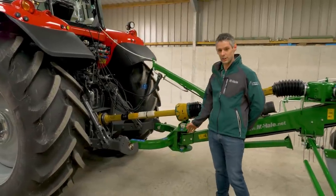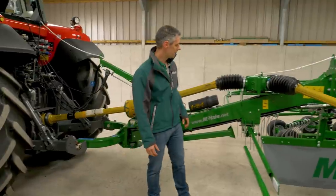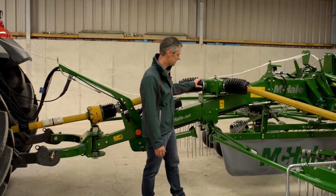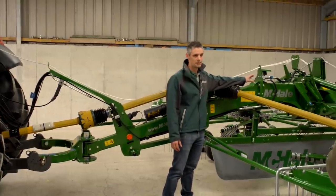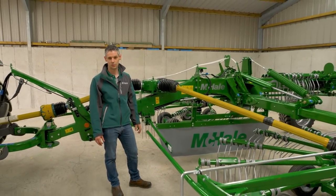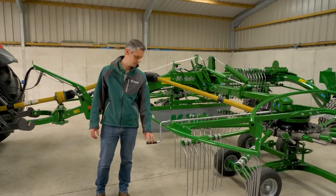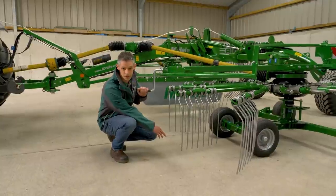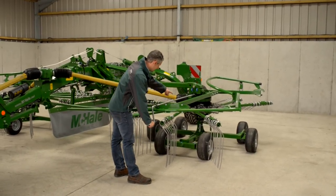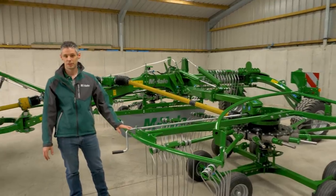There are a number of grease points on the machine — these should be greased daily, with all greasing intervals in the operator's manual. Moving back to the Y-gearbox, you can change the oil once a season and it's pretty much maintenance free. Flow control valves can be adjusted when changing the rake onto a different tractor, in small increments to ensure each rotor lifts and lowers at the same speed. For rotor height adjustment, the tines should ideally be set between 10 and 25 millimetres from the ground, adjusted by rotating the handle up or down — height is shown on the indicator at the centre of the rotor. Make sure the number is set the same on both sides.